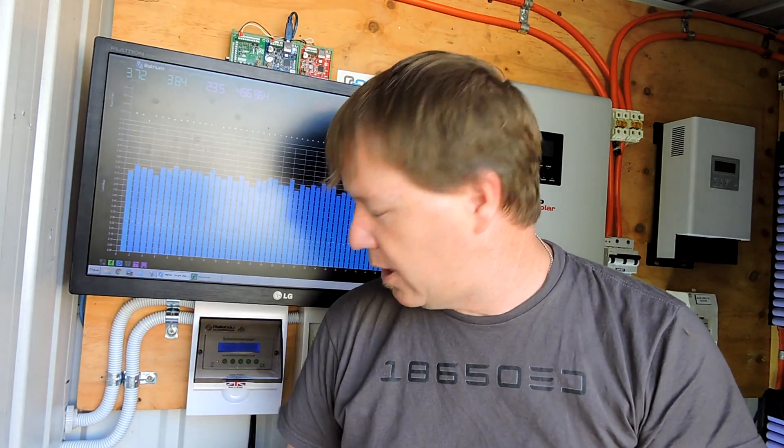You can also tell it to boost. What I've done is programmed it so it will boost between four and five o'clock in the evening, which just guarantees that if we have a bad day it will heat the water back up so we can all have our evening showers. But if it's been a really good day it won't come on at all. I reckon it's going to cost about $80 a quarter. I've also turned it on for an hour in the morning just to boost the hot water up in case anyone wants a quick shower — I could turn that off and save money, but I think that's a comfort thing.